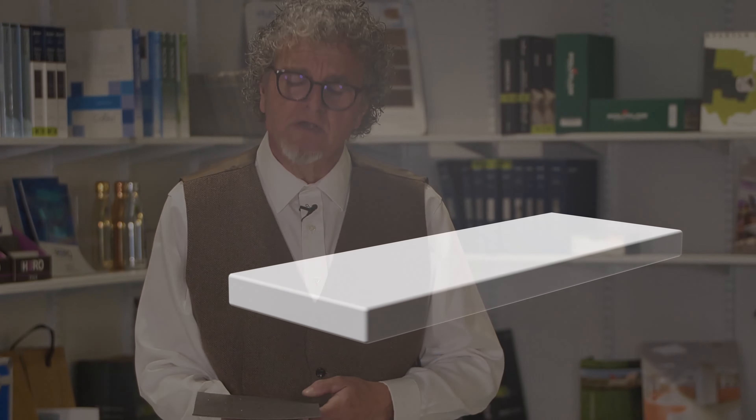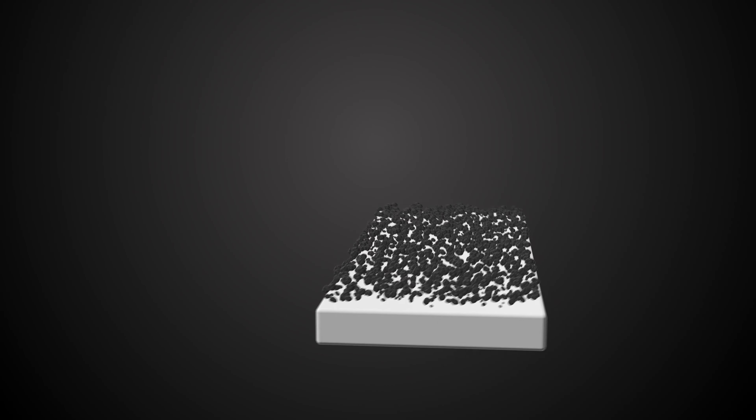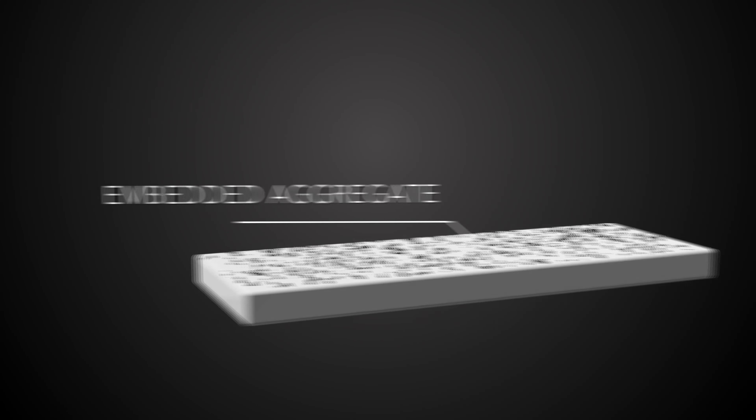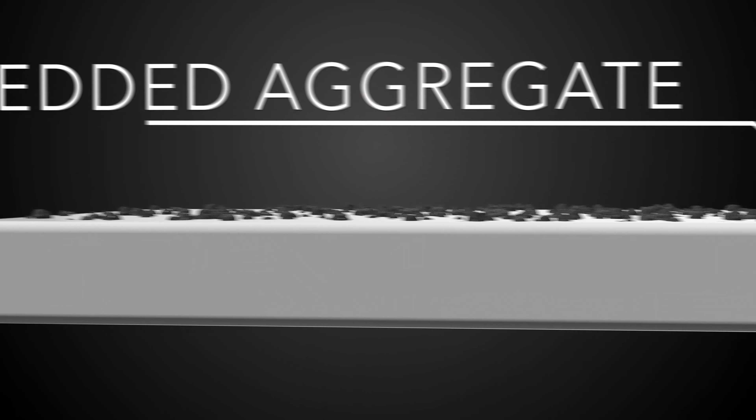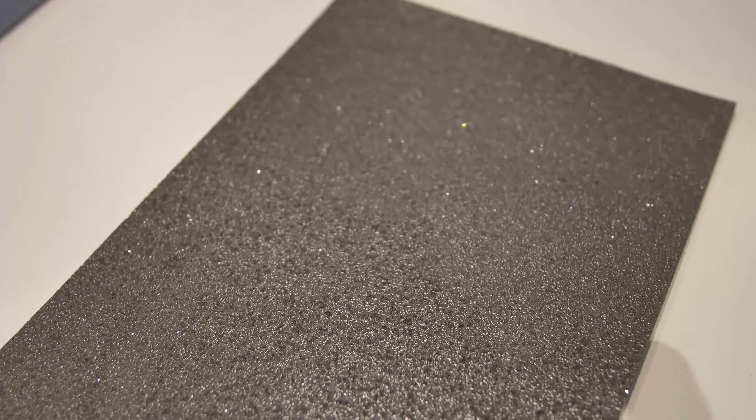The way safety floors are made is by taking a standard homogeneous sheet vinyl composition product and embedding it with some type of an aggregate — something rough that grips the feet as you walk across the floor even when they are wet. The early products that came out over 35 years ago used carborundum as that aggregate, so you get a speckled and sparkly kind of look like this one, or black specks like this one, and you've probably seen these floors in high traffic areas in transportation and so on.